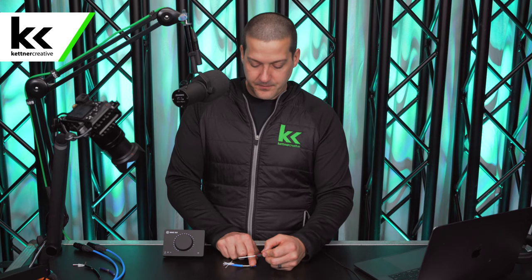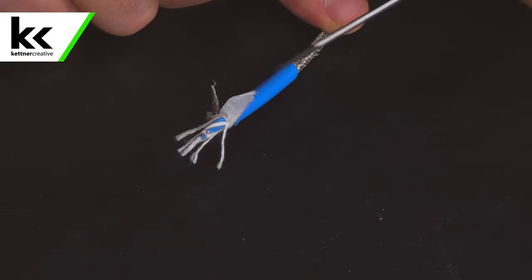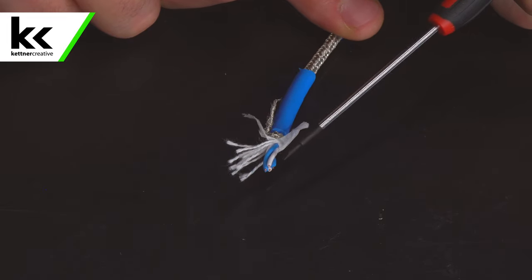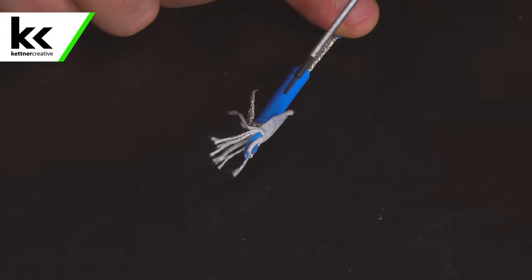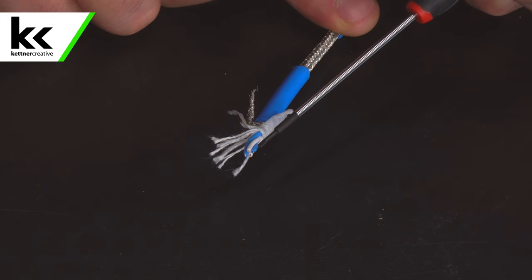Now let's look at the other end of this cable. We took all this tin off the end and gathered it to one side — this is what you would solder to the ground of your connector. Inside the tin shielding there is a paper wrap that gives 100% coverage. Inside that, there's cotton yarn wound between the rubber cores of the cable to help give it a little more protection and keep the cable nice and round, adding to that fullness and protecting the rubber cable on the inside. And inside that, of course, we have the four different copper runs.